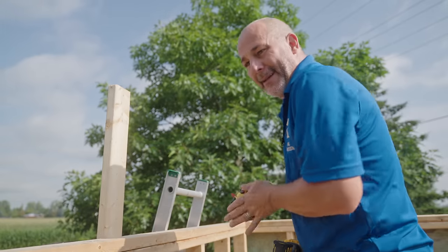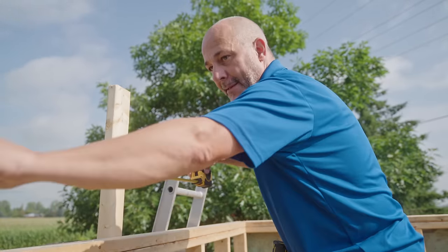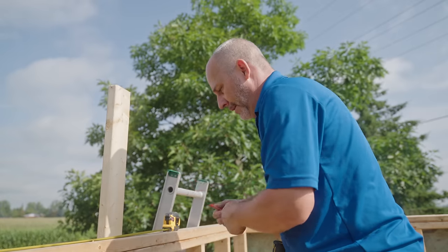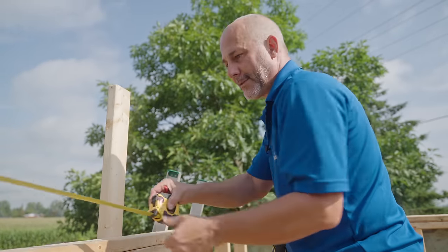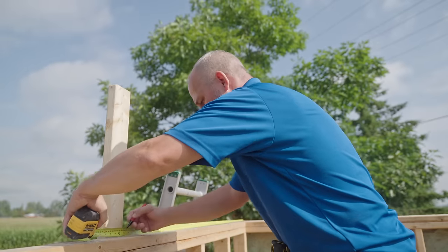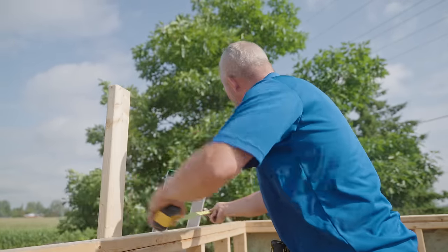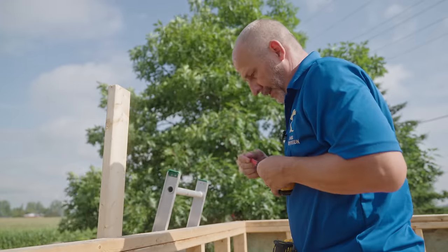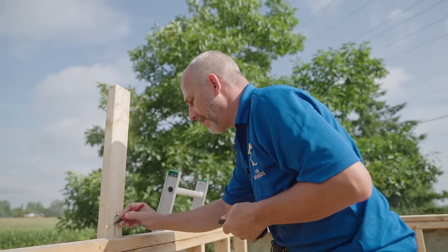And in order to do that, we're gonna measure to 5 feet. Remember, this shed is 10 by 16. So we wanna just double check our side. Here we go. We are just a hair off with this double plate, no big deal. This is now my center line, okay?